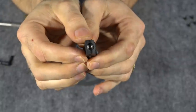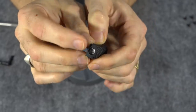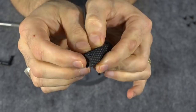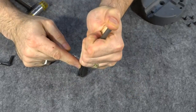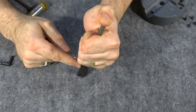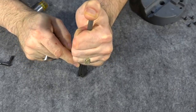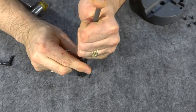Once you have this off, you're going to notice there's a little plunger in there and a little pin right there. What you have to do is depress this plunger while you push this pin out. This will be under spring tension also, so be careful once you get the pin out. Now this is where I would normally use a vise, but since most people don't have one and I can't find mine, I'm just going to do it by hand. It's really easy — just force it down just a little bit, push that little pin out, boom, and there it comes.